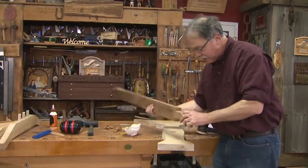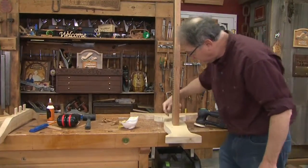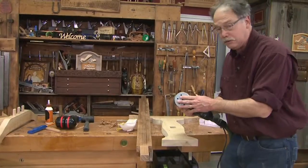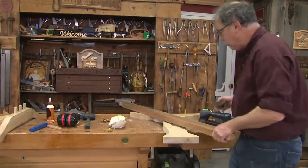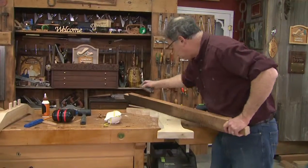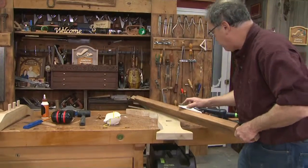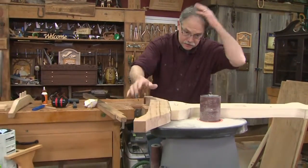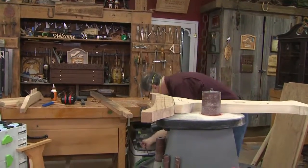Let's take a look — that tenon, the wide part, needs to be up at the top. It goes straight on through and that's square all the way around — a perfect fit. To get that I used a microplane and also this three-and-a-half inch sander that's super aggressive with different settings. I have it set aggressively to sand and profile the edges of all the work pieces. I also like to use a low angle block plane carefully with the grain to break any hard edges. I don't need to sand this perfectly because it's going to have milk paint on it — I want a bit of that rough texture to add character.